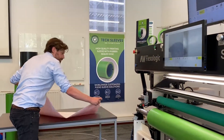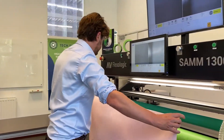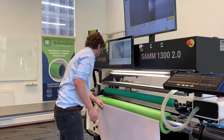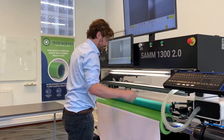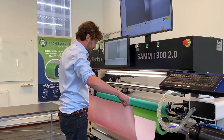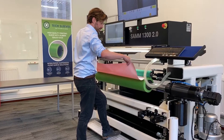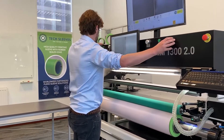I have a piece of tape that's already pre-cut to the right size, so I can just apply this on my sleeve. I lower my pressure roller because that's going to assist me in applying the tape. I hold the tape and I make sure there's no tension in the tape to avoid any creasing. I'm just using the foot pedal and the pressure roller to apply the tape.